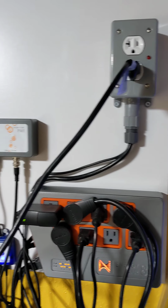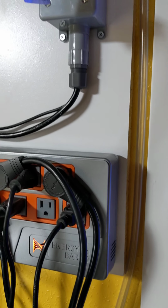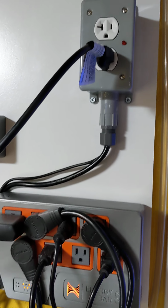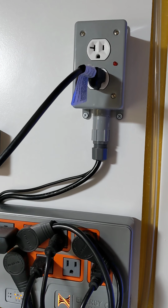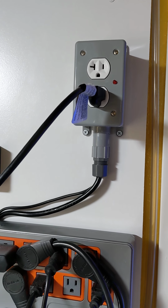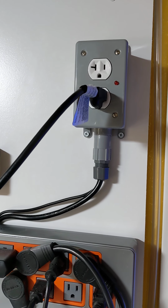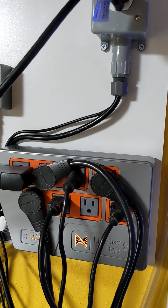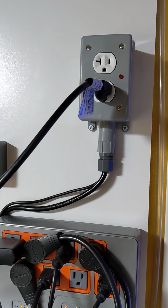So you plug in the outlet saver to an outlet on your circuit, and then run the 24 volt in there. I'll go over that. The alternate method, the relay I'm using is rated for 20 amps, and it can run on 120 volts or 24 volts DC. If you did the 120 volt, you'd have to run the signal line a little different, but then you'd have to plug it into your EB832, and then you really don't gain much. So I'm just going to run it off my accessory ports because I'm really not using them for anything.